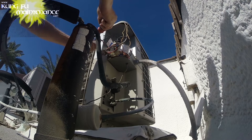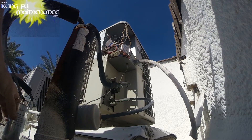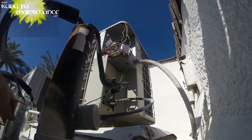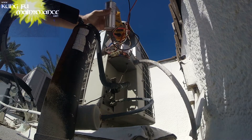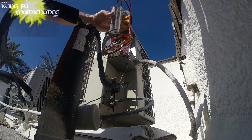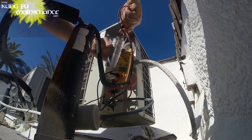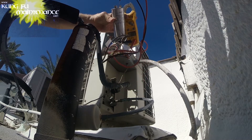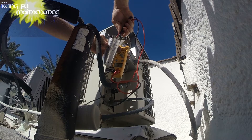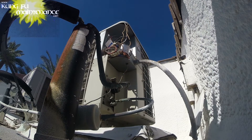Just for interest we can measure this and see what it's at — I changed this maybe two months ago. Common to Herm: 45. It's still good. And common to fan — of course it should still be good as it wasn't used at all for the fan side — 4.96. So this just needs a 35.